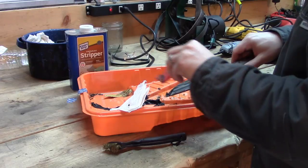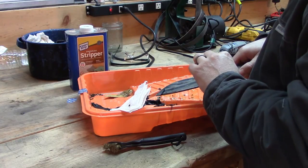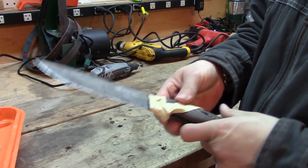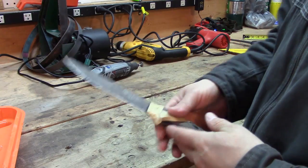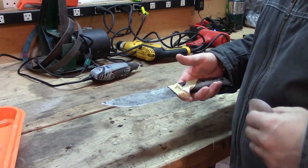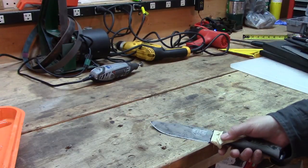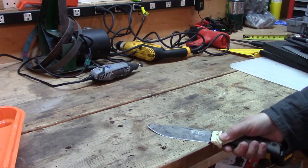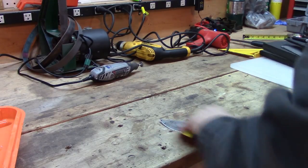Once we have this cleared off, we're going to do a little finish sanding. I'm going to finish getting the rest of this coating off real quick, then show you how we finish it up. Taking a piece of 180 grit — you can use 200 or 400 grit, it doesn't matter since I'm patinaing it anyway. Be careful: put that knife down on an edge where the sharp edge is protected so you can't get cut. Roll it up that way so you cannot get cut on that edge, then just sand away and that stuff comes off pretty quick and easy.